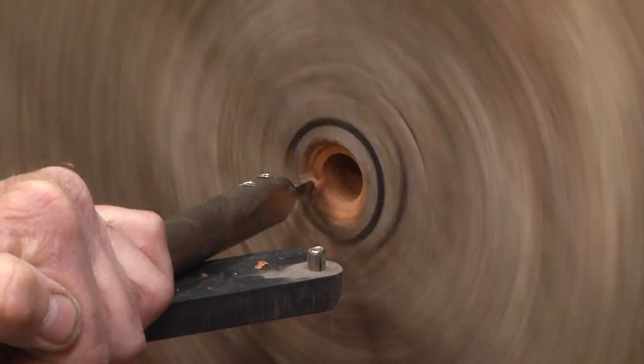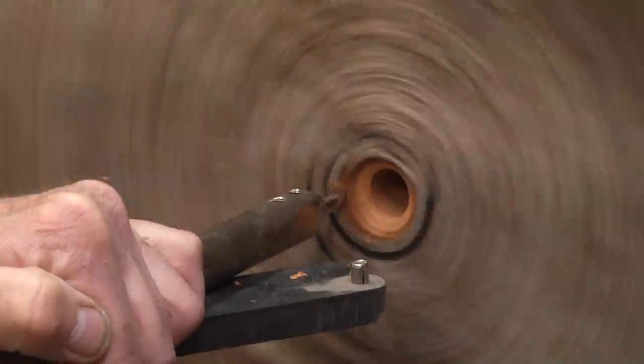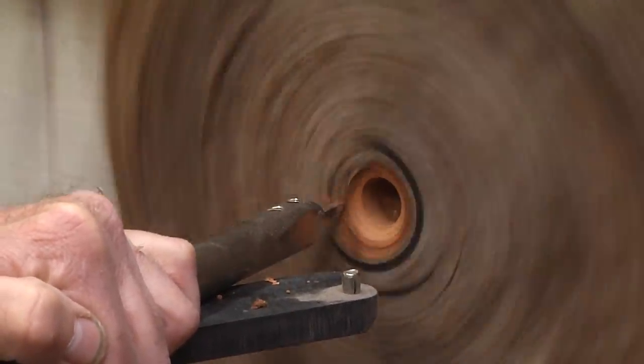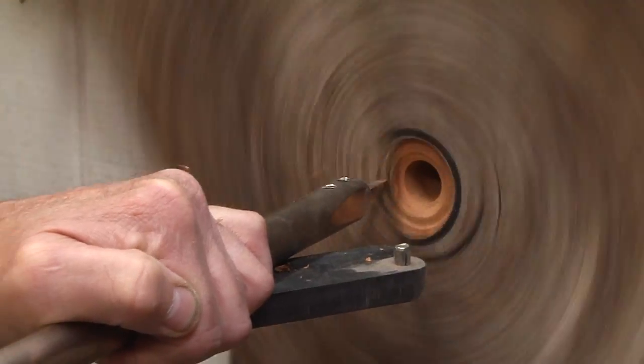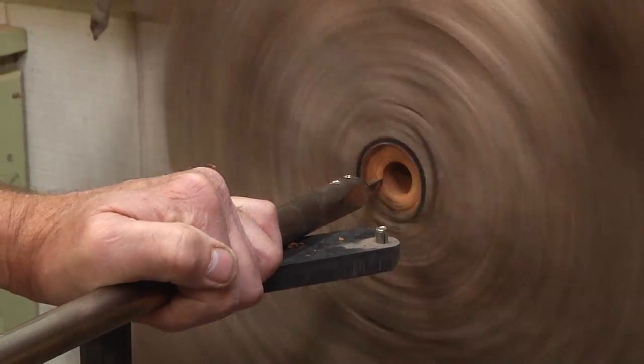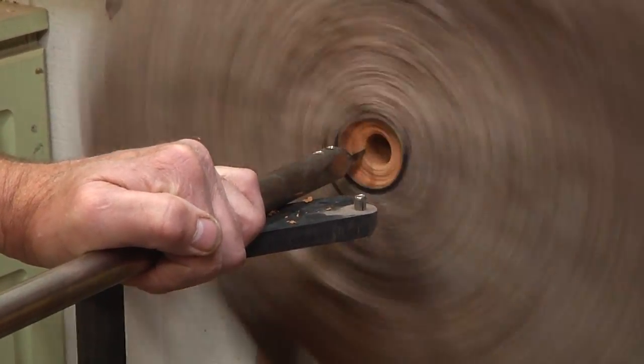What happens is, as you're going like this, the left side of the tool wants to engage. So that's why you just want to do like a quarter inch at a time on this. And since we're going through bark, it's a rough cut. But the hollowing system takes a lot of the pressure out. And most hollowing systems, they all do the same thing. I'm not pushing this one, I'm just talking about the functions of them.